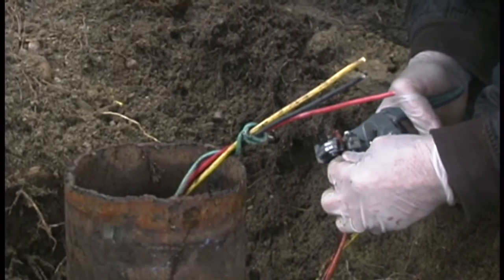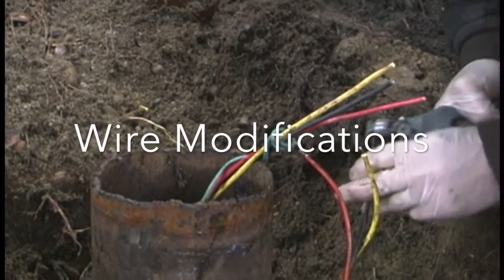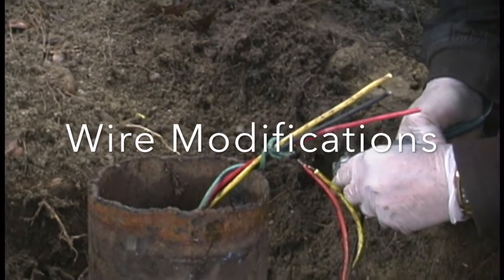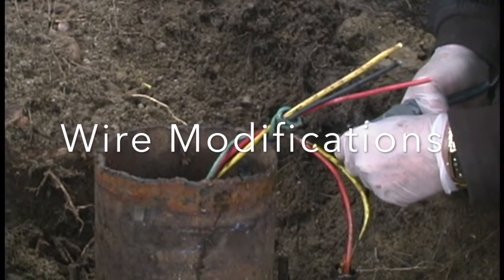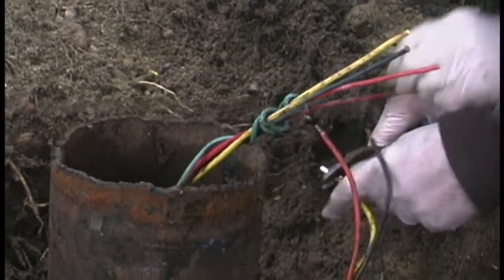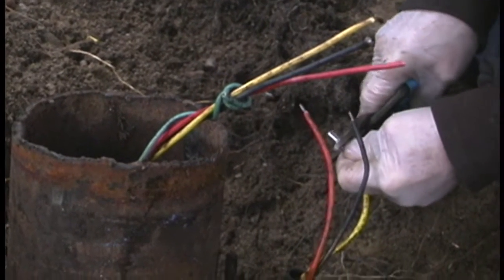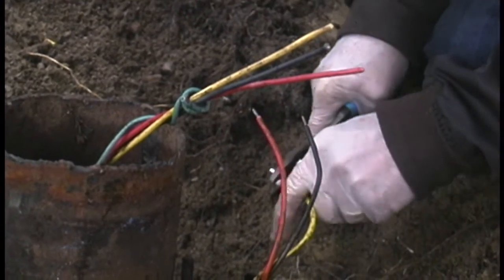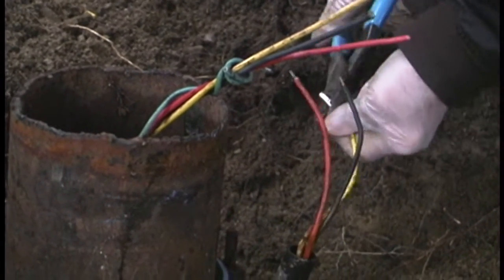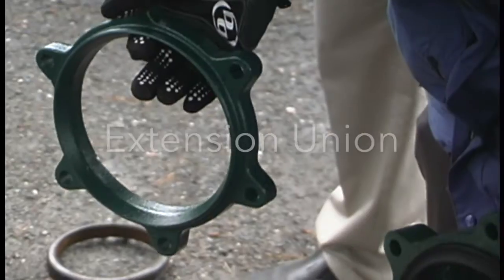Make sure you do shut the power off before you do this — that could be a shocking experience if you don't. If you're doing it for a homeowner, make sure you do it yourself and the breaker is backed off. What he's doing right now is trimming off the wires, a little prep work. And we're now putting on these silver compression connectors — these are the proper connectors for this type of job. They're all silver coated and they have a sleeve that goes over them.